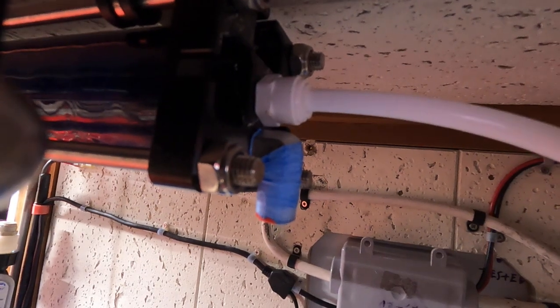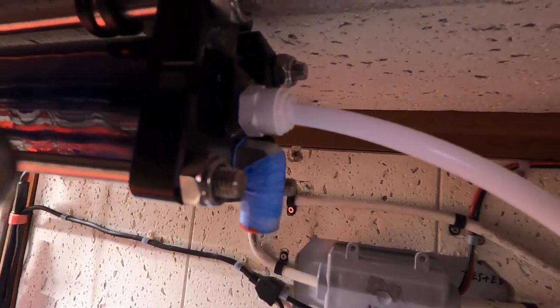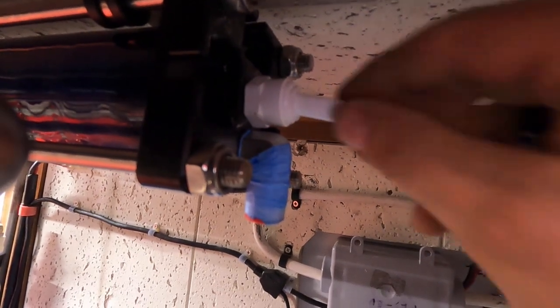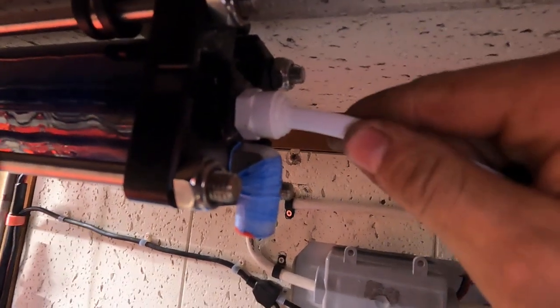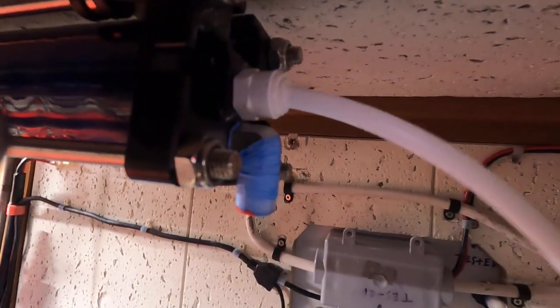in there. And if someone is doing this and hasn't used these fittings before, it's easy to push and stop. And if you only feel it going like an eighth inch and it stops, wiggle it around until you feel it do that. It'll really fall into place. You'll feel it, you'll know as soon as it happens.